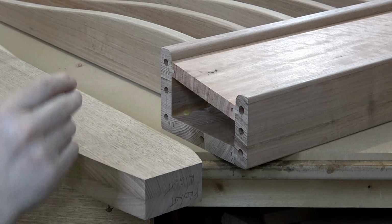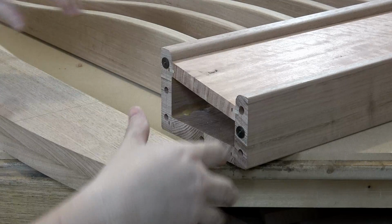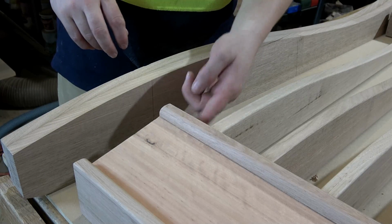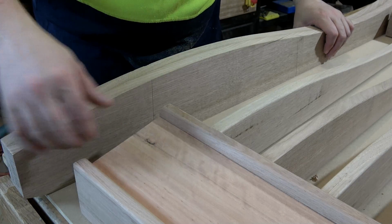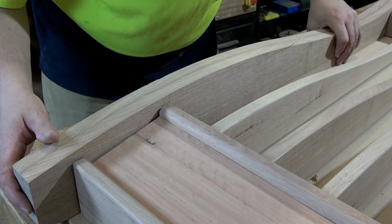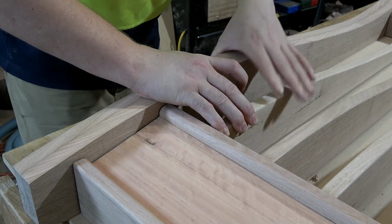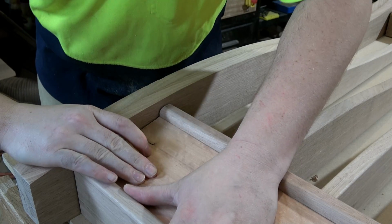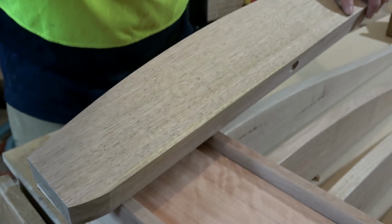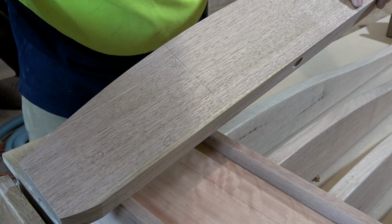So using these little dowel center points, I can put them in the holes here. I only have 4 of them, so I'll have to do it several times. They have a little point on the end of them. So I line that edge up with this line here and then press it in, and that'll give me 4 points that I can get half of the dowels connected with. And there I have 1 point, 2 point, 3 point, and 4 point.